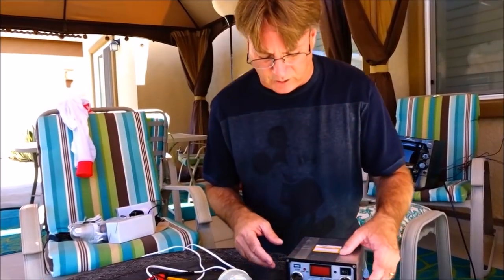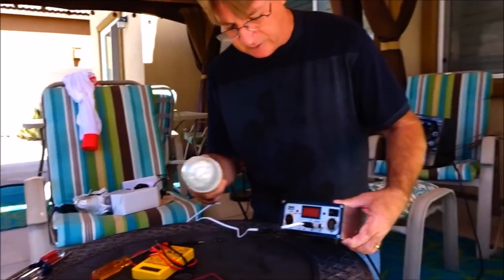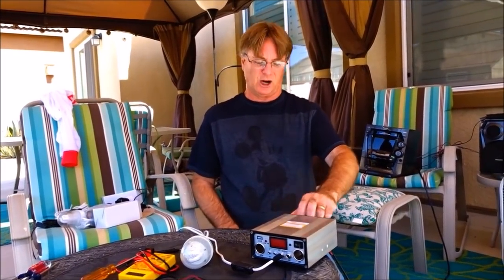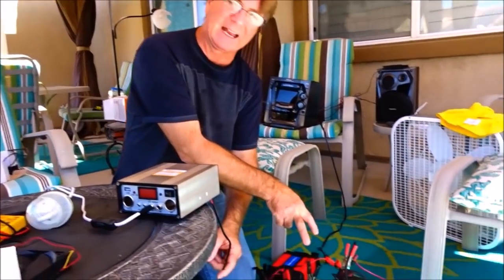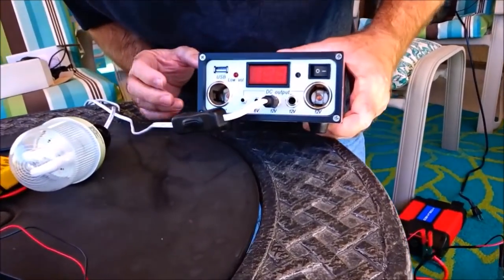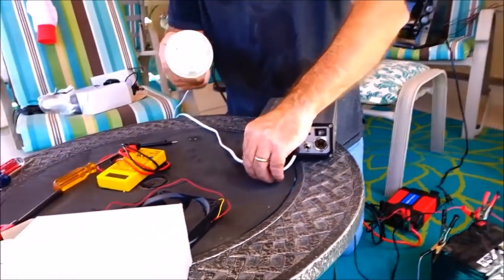Do not throw out your 45-watt charge controller, because in the 45-watt kit it came with a couple of these awesome lights and some other things that you still want to use. I do not have the charge controller hooked up to the solar panels, but I do have it hooked up to the battery side. The battery current is coming in — I can turn this on and you can see I have 13.3 volts here, and this is a very bright only 5-watt light.